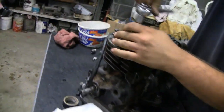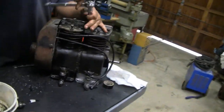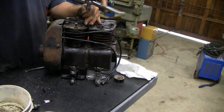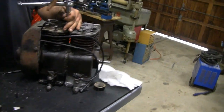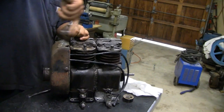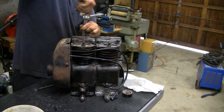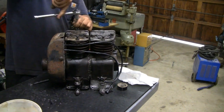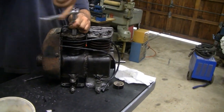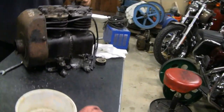Absolutely. Looks good, doesn't it? It does. It probably looks like something after all this time. How'd you like that coil? I think I spent two hours on that trying to get that to work with that flywheel there. Well, it works good — that's what we needed. A lot of modification going on here, but it works well. We spun the thing and got a real hot spark out of both wires. So that's good — we're very optimistic.